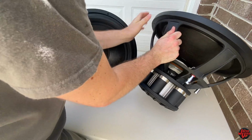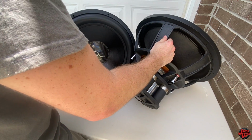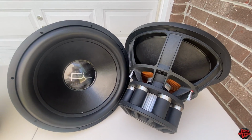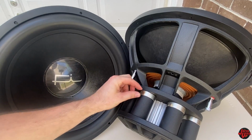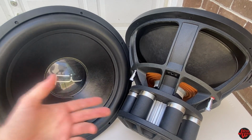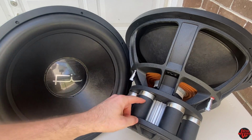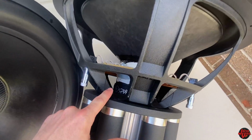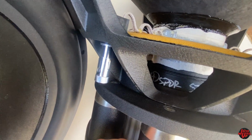A little bit more close up of the subs before I get them installed and tested on power in this video. So make sure I got them staged right so y'all can kind of see, get them zoomed in a little bit. Really nice subwoofers. I guess this is the Neo portion of it. These are made in USA at the Phi factory. It came from Las Vegas. They were weighed at right over 70 pounds. So these are the 4.7s, 4-inch voice coil. If you actually look in here, you can see that I got the Omega coil as well. They're rated at 3,500 watts RMS.